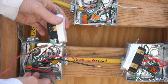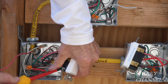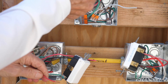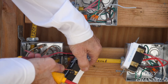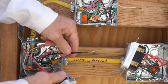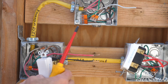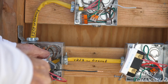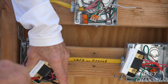Now we're back over here to the first three-way switch box. I'm going to put the ground wire onto this three-way switch and fasten it securely. This is your switched hot wire — it comes up here to the light — so that goes to your common terminal. Tighten that down securely. Now we just have the traveler wires — the same ones. We put the red one on top and the black one on the bottom. The red goes onto the top terminal, tighten it down securely, and the black goes to the bottom terminal — tighten it down securely.